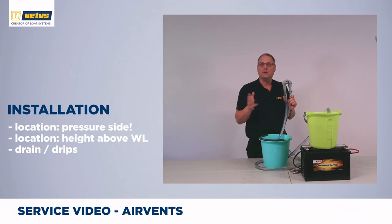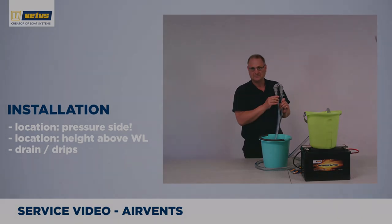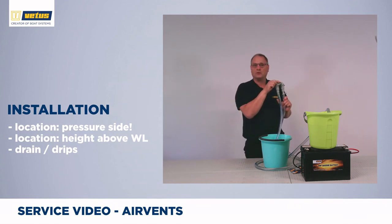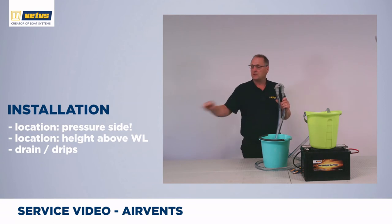On sailboats, be aware that even if the ship is heeling, the air vent should be above water level — typically the centerline of your boat is a good location for an air vent. If you decide to use the hose option, either with or without an installed valve, make sure the hose continuously runs downhill and that the end of the hose is in air. If it's submerged in water, it will block the valve from opening correctly.